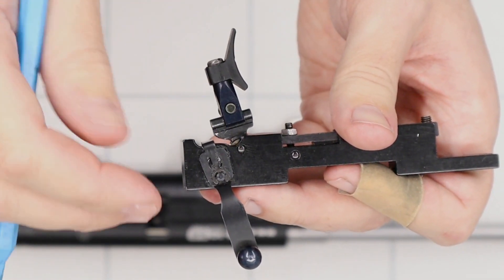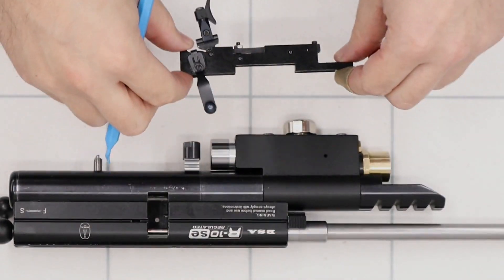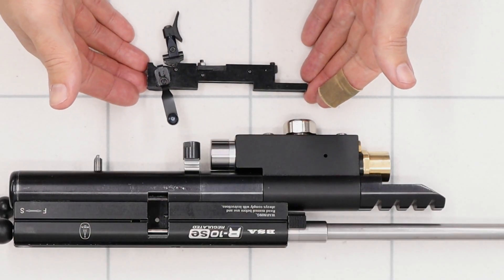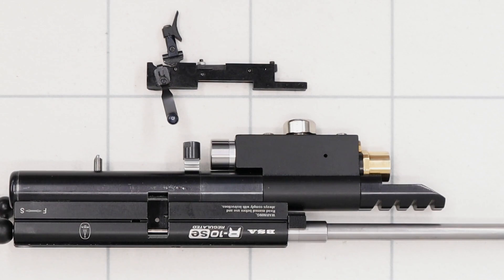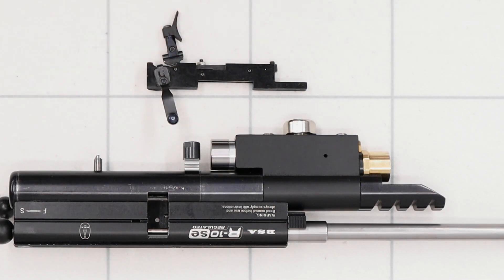You can remove these sears by just banging the pins out - they're not normally that tight from the factory. Now while we're talking about triggers, you have to be very careful when you're changing or polishing the triggers. If you take certain surfaces too far it can cause the trigger to stop latching. The idea and goal of polishing a trigger is to remove as little material as possible in order to get the finish that you're looking for, and as such you should really only be using very fine sandpaper - starting at something like 800 grit and then working your way up to 2000 grit, going through the grits nice and evenly, then finishing off with autosol or metal polish.